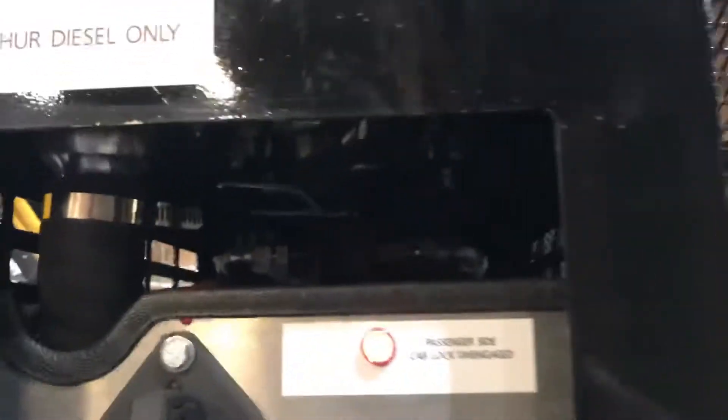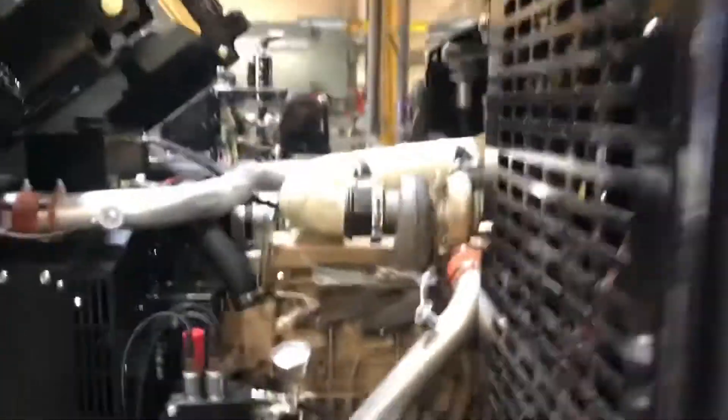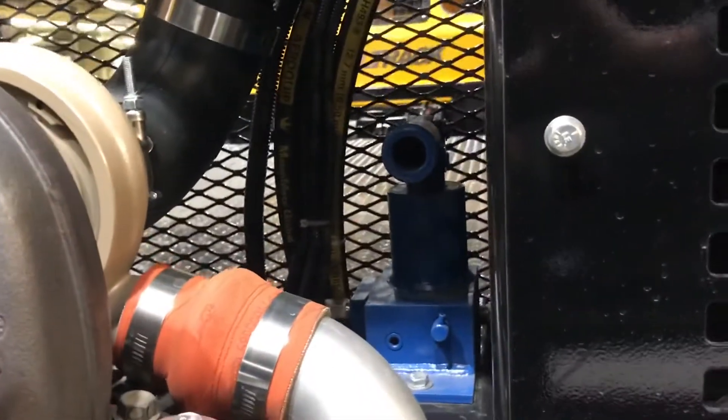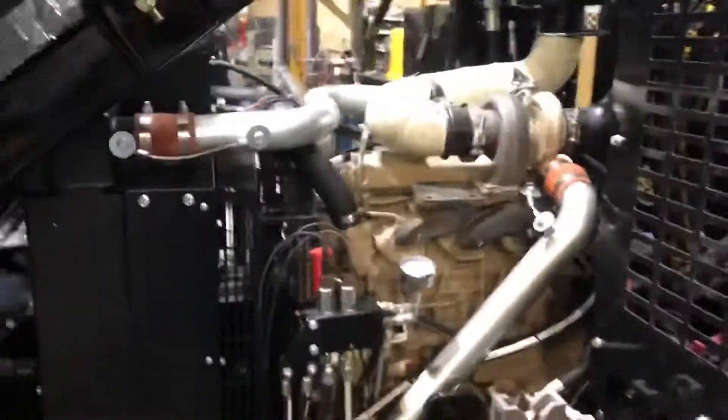Those should be bypassed. I've already taken the liberty of raising the cab. The brake release pump is located just on the other side of the turbo — you can see there is a manual pump. We have to actually pump that up to release the brakes.